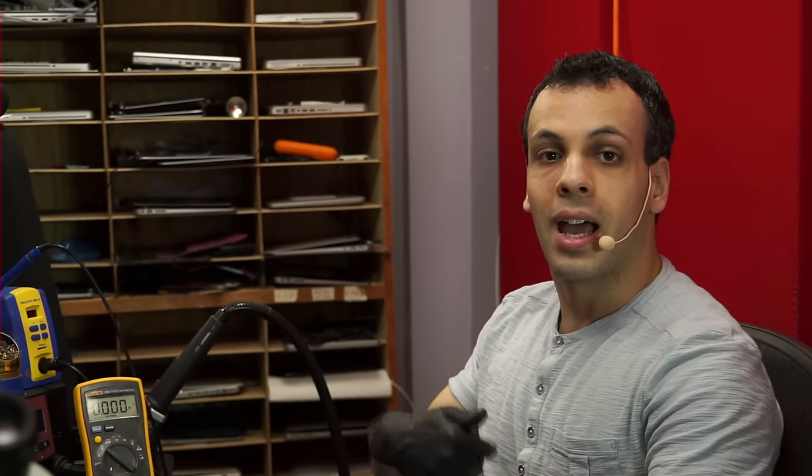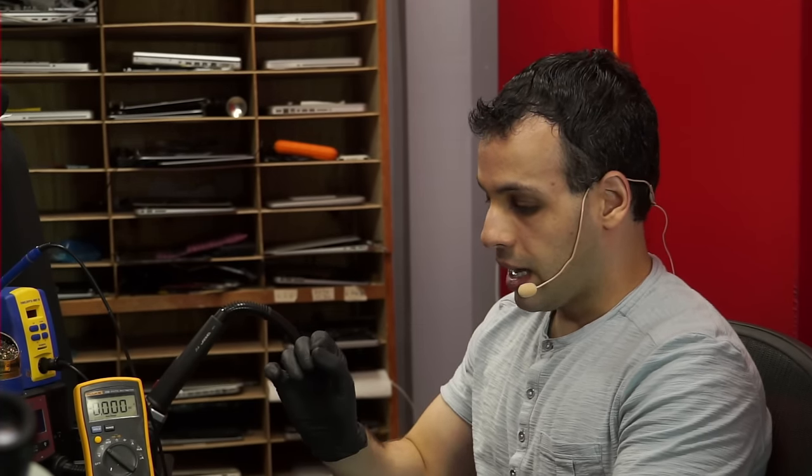So what I'm going to do right now is check to see if I'm in an S0 state, meaning I'm going to check and see if an S0 power rail is present. If I have my S0 rail, that means two things. The first thing it means is that the computer is getting itself to the point that it's turning on. It is turning on. I am in an S0 state. The second thing it's going to mean if an S0 rail is present is that everything before it has to be present. My S3s are present, my S5s are present, my G3 hots are present, which means I can cross those off the list of checking. And if I can cross those off the list, that makes the troubleshooting process that much easier. This is where thinking about sequence is going to save you a lot of time, hassle, and misery.